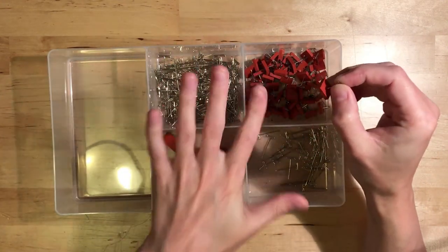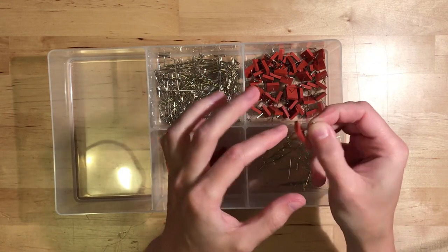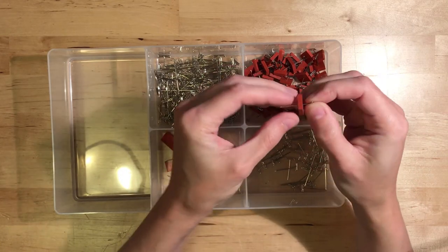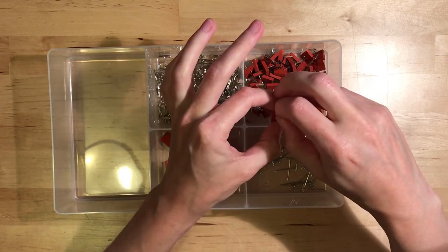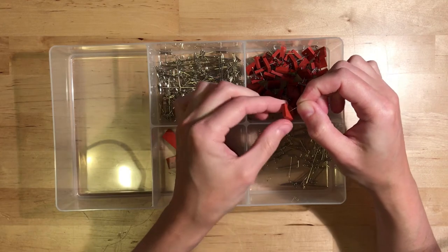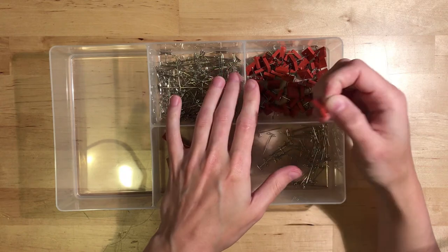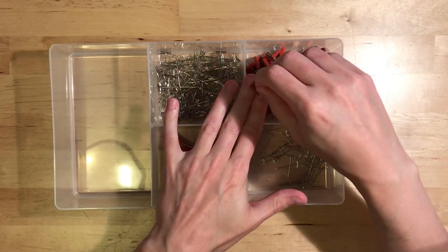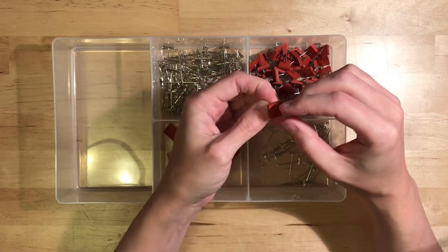So what I wind up doing is, if this is the stick, I'll push it in so that this is beside the stick, and then this kind of puts the pressure on. But the great thing about this is it's really friction fit, so I can push it into the work surface and then push this silicone pad down until it's putting the right pressure on, and it will push up just a little bit so that it gives it right down pressure without hurting the wood at all. And this is silicone, so I can put this right on a seam and shoot glue under it, and the CA glue won't stick to the silicone.